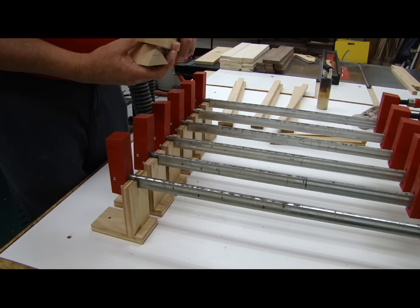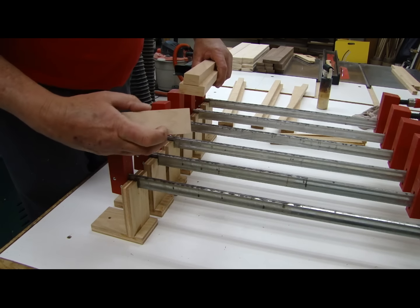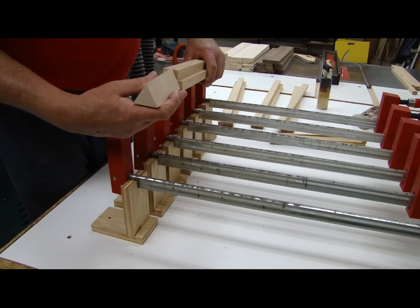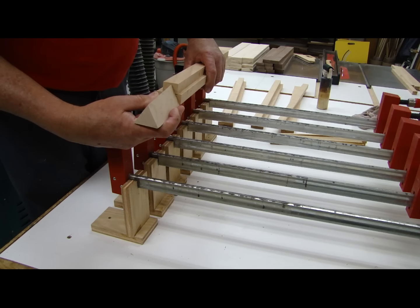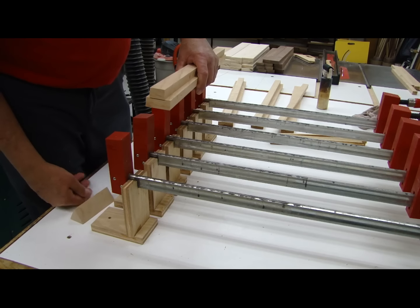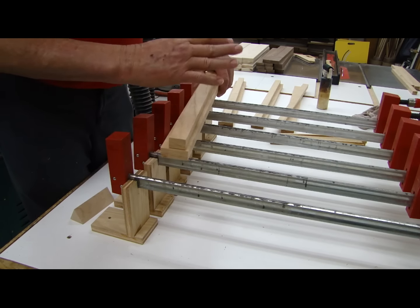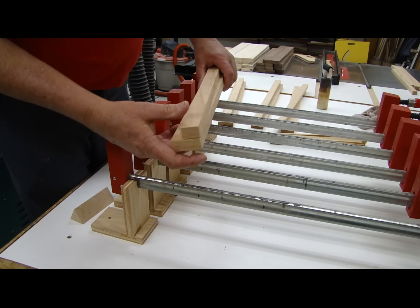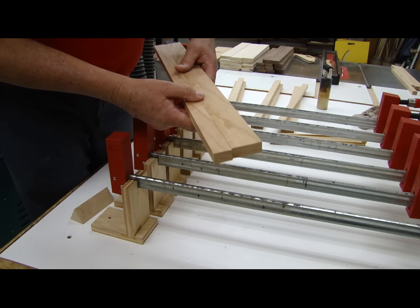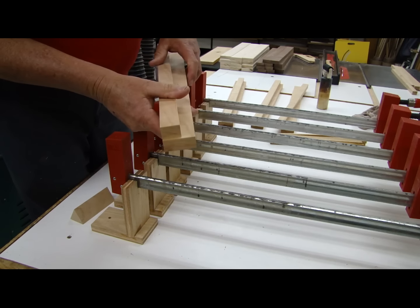And my first glue up is going to be two stacked pieces to form the center core triangle. If you have some 6/4 or 8/4 stock, that'd probably be best. All my stock is 3/4, so I'm going to glue two pieces together to be able to create my triangles. I always try to color match the stock so everything's cut from the same board. And the two strips here are actually cut side by side when I make these, so I get the best chance of a color match.